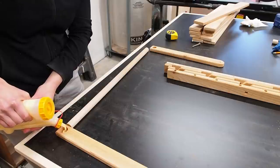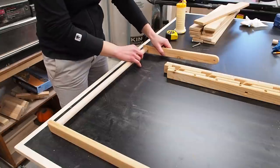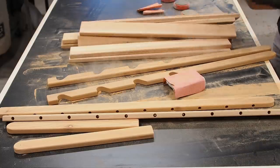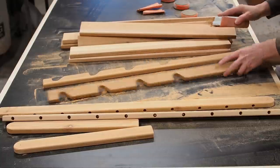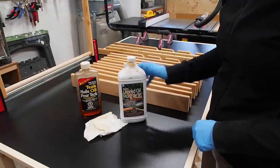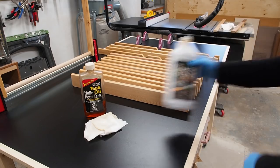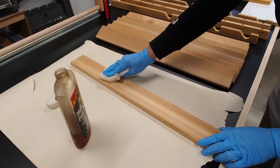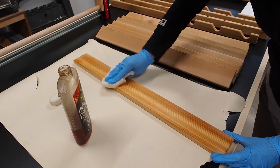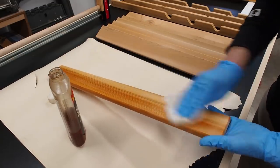I used some glue to assemble the parts. The dowel isn't made of cedar, but I'm hoping that once the finish is applied it won't be too noticeable. Off camera I did a lot of tedious sanding using 120 grit. After cleaning away the sawdust, I decided which finish I would use. I want to use an oil finish and I've narrowed it down to linseed or teak oil, which seem to be the best for cedar used outdoors. I personally hate the smell of linseed oil and prefer the warm glow of teak oil, so I'm going with that. I simply used a clean cloth to rub in the finish and let it dry overnight.